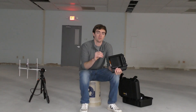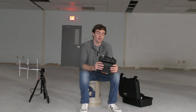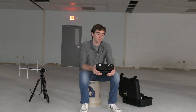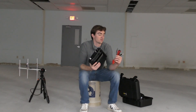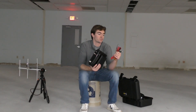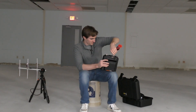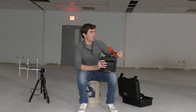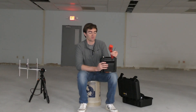And this has some benefits that we'll talk about a little bit later on in the video. The first thing you're going to need to consider when deciding how to set up this HR-652 repeater is how you're going to power it. It comes from the box with the radio repeater and a DC wire harness. This is a very basic wire harness — it has two bare ends and it attaches from an aviation-type pin right on the top of the repeater. So that plugs into the top of the repeater, and with your bare wire ends you'd either run that to a third-party power supply, like a variable power supply that you might buy on Amazon for around $60, and just be sure to feed it the correct amount of power.